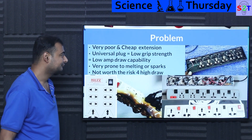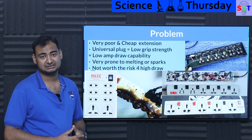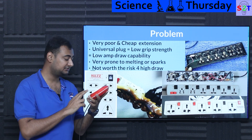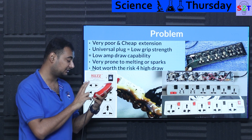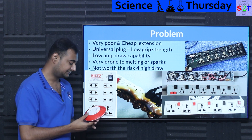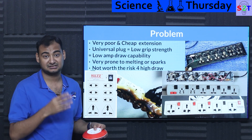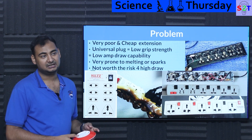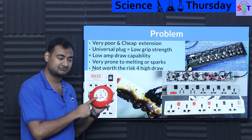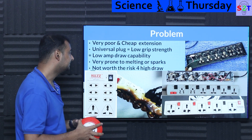The biggest problem in India right now is ludicrously cheap and poorly designed extension strips — what we call power strips. They are bad because they use what's classified as a universal plug socket, designed to accept almost half the international market: UK plugs, some North American plugs, and more. Honestly, half of those plugs should not be plugged in because they run on different frequencies. Companies keep making them because switch-mode power supplies — the basis of almost every charger — can run on anything from 110V/60Hz to 220V/50Hz. But for heavy-draw equipment like computer UPS units, these universal sockets are simply not appropriate.